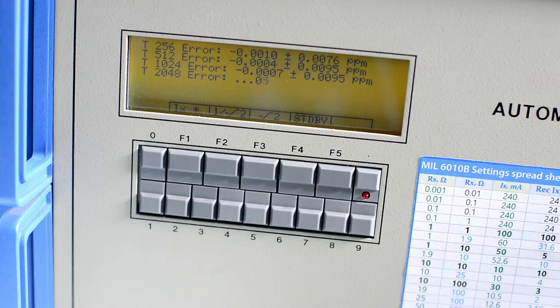You can actually access most of the intercomparisons and international comparisons. The reports and results are public. You can go to the BIPM website. There is a KCDB, which is their database of all the different measurements and all the different units. They have sections for voltage, for resistance metrology, for pressure, for weight, all that. So you can find the relevant reports, as pilot laboratories often publish those reports either on KCDB or on their own websites. So you could access and read what the measurement actually was and the details about it, including the analysis of agreement between different labs. So I would recommend checking out the BIPM KCDB reports.